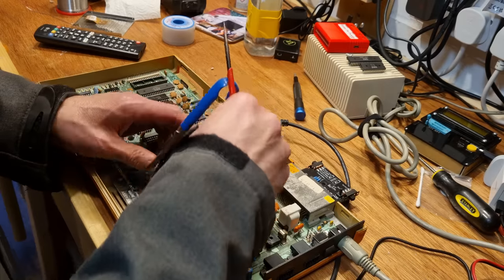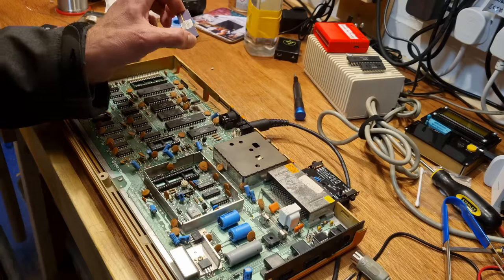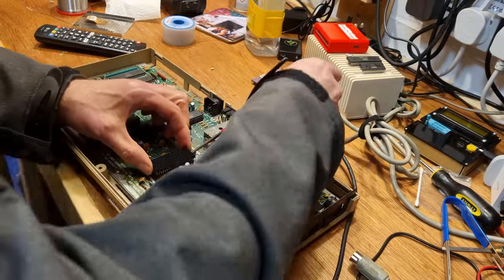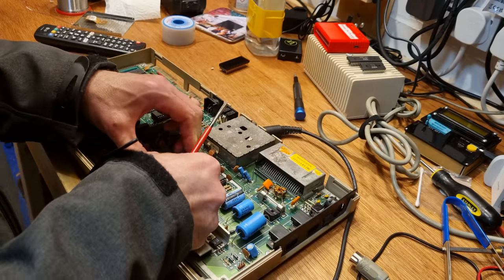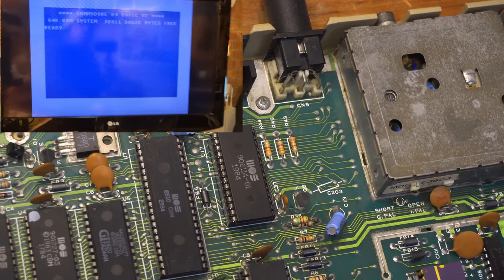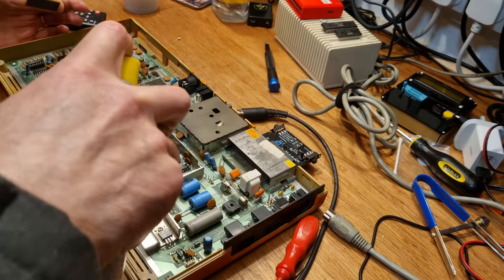The CIA didn't make a difference. The only other easy chip to check now is the VIC-2. Even though the display is just a black screen, I can see there's a signal being output, so I don't expect this to be the problem. But it's worth eliminating the simple stuff before you get to more drastic measures. And that VIC-2 is working fine in my test machine — so what next?